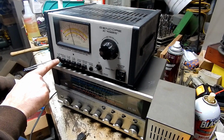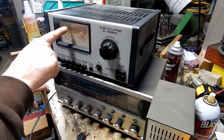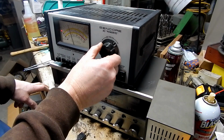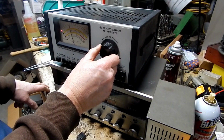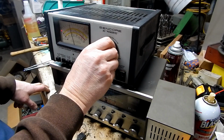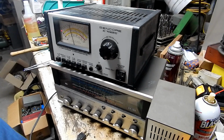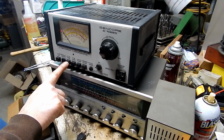So when I put this online, it's reading the line voltage right now. It should be reading up here, and it's only showing around 50 volts. So obviously that's incorrect. All I need to keep in mind is that when I put it on output, I can now vary the output, and when I get up to 50 there, I'm actually at full line voltage, because this can actually over voltage. I think this can go up to 140 or 150 volts AC. I don't remember exactly.